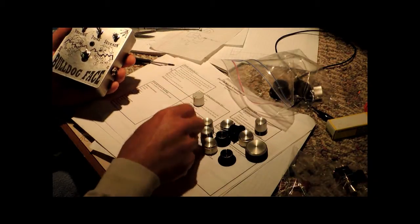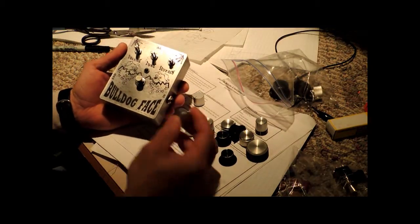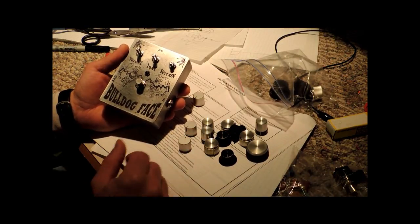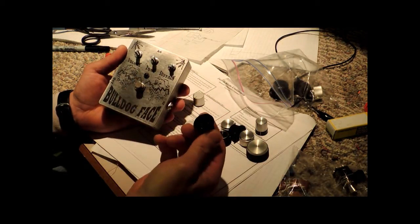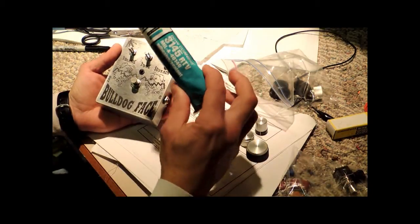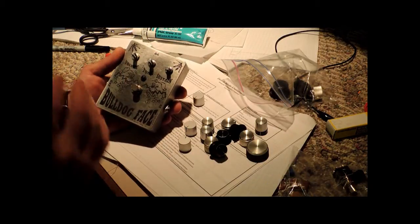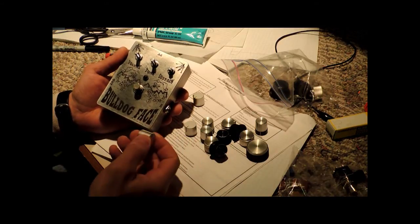And so I've thought, well, with the ones that I have and the type of chassis I have right here, I think I like these. These came off an old receiver that was salvaged some time ago. Depending upon the diameter of that internal hole, you're going to have to decide which one works. If it seems too loose, you could put a little bit of that sealant on the hole, and then push the knobs down on the pots, and let it set up, and it should work just fine. The ones that I have here all seem to work pretty good.